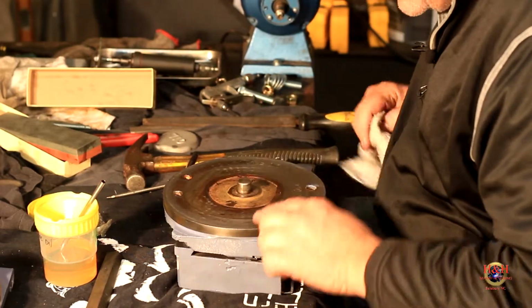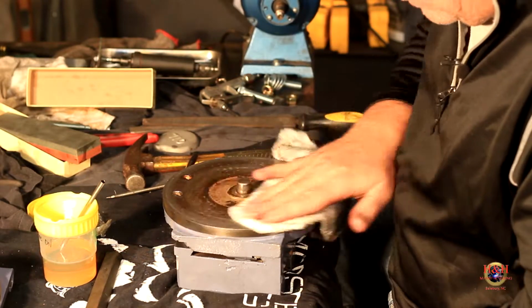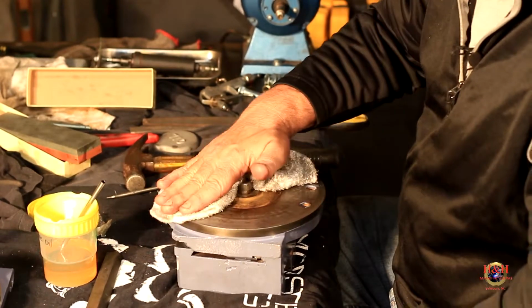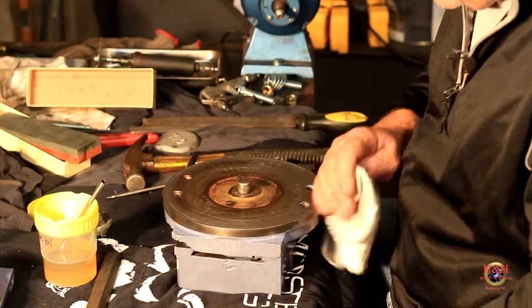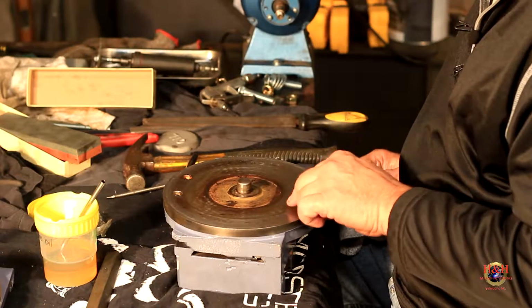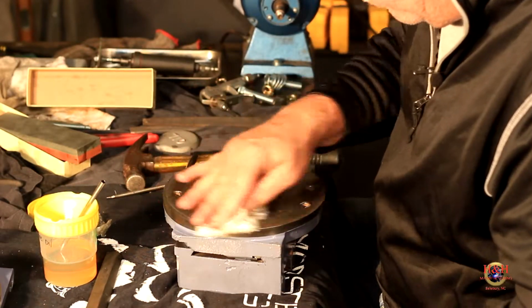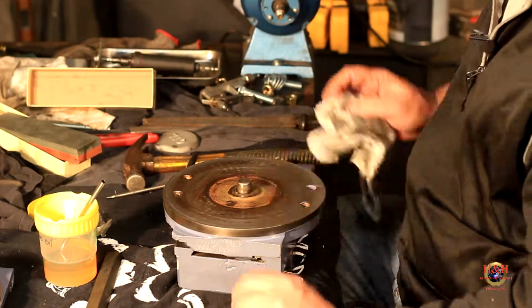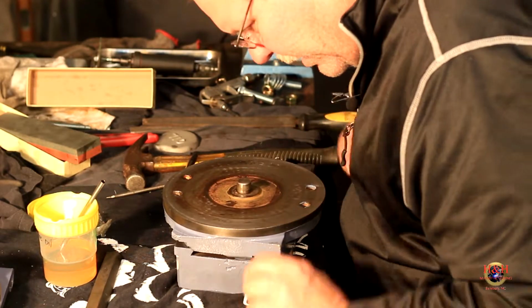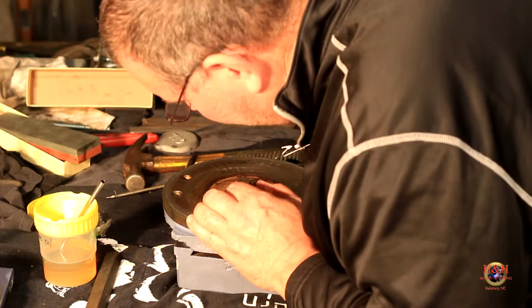Look, you can see the flaking in it again. So, you know, might need to oil it down a little more. Might even see more of that. I don't know if you can see it there. You can tell where I'm hitting the high spots with the stone and it's leaving the low spots. And it looks like when they used to do the flaking in the thing to create the gap for the oil. So it looks really, really good. I'm thoroughly impressed.